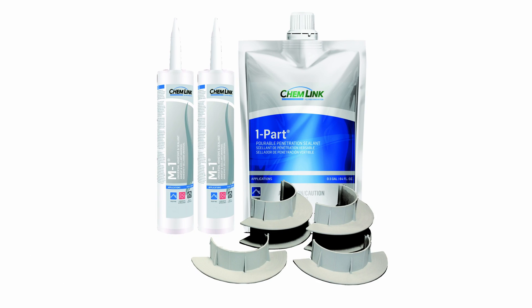It is a little puck — a base plate that gets screwed into the decking. It has a post, and on top of that post you put an L-foot, then solar rails, then the solar panels. To waterproof that base, we use an e-curb from Chemlink, which is a plastic curb that has a sealant under it and then a one-part pourable sealer that fills the base. It provides an absolute watertight seal and lasts a long time.